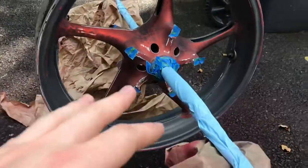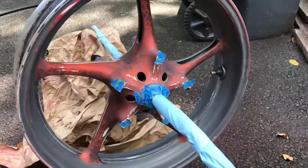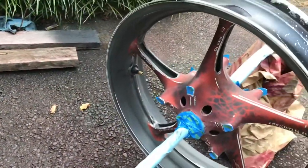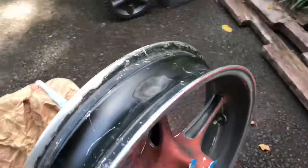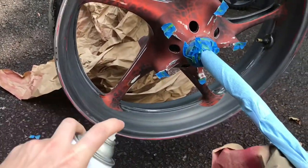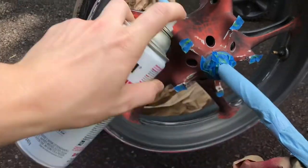The key thing I'm trying to get across is you want to tape off the things you don't want painted. For instance, this is an aluminum dowel — I've taped it off and put cloth over it. After you've sanded and made sure it's nice and clean, gotten all the imperfections, dirt, dust, and debris out, you simply take the rattle can, hold it about eight to ten inches away, and go up and down, side to side — pretty much from every angle — doing what they call sweeping sprays.